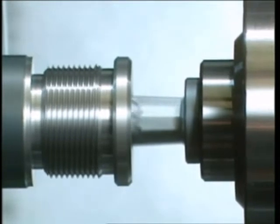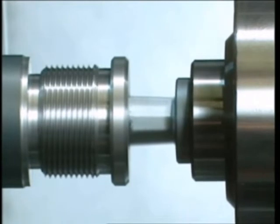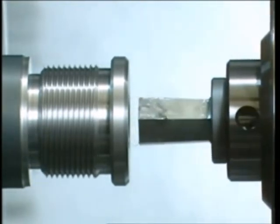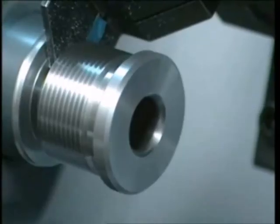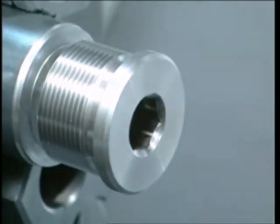As can be seen, the two parts rotate at the same speed. The oscillating swinging movement that the broacher lends to the broach and the forward feed provided by the machine tool — between 0.1 and 0.3 mm per revolution — produce the desired hex shape.